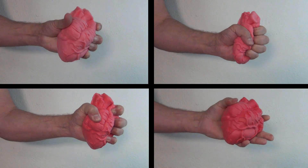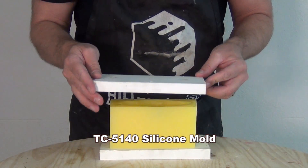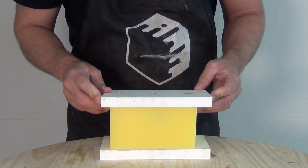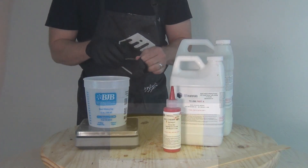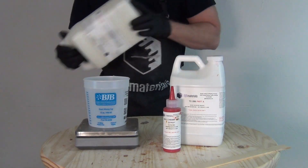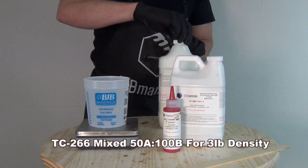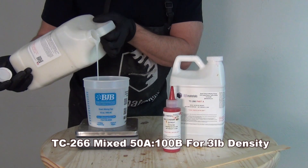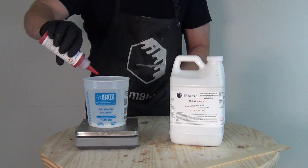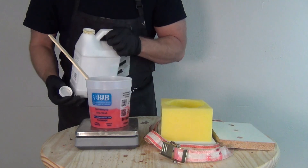I'm going to cast a few of these little foam hearts out of this mold. This is a TC-5140 platinum silicone mold — a fairly firm silicone mold. The top and bottom are melamine-coated particle board that I drilled some holes in for a very basic venting setup. I'm going to pour several copies of foam hearts using the different densities, starting with the 50 to 100 density. This is the TC-266, the softer cushion foam. When we mix it 50A to 100B, we're going to wind up with a three-pound density in free rise. If we pack that a little bit, we'll get a thicker skin and a higher density. Because foam reacts quickly, you want to make sure you add your pigment to part B before you add part A — stir that in before adding part A — to ensure maximum working time.